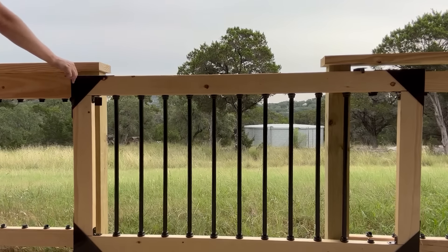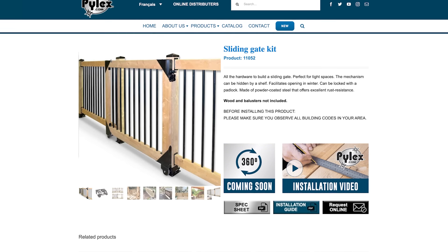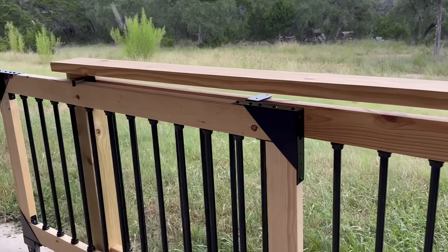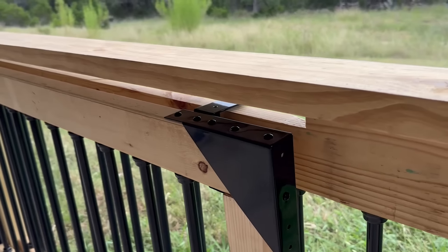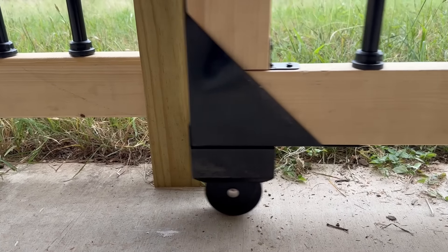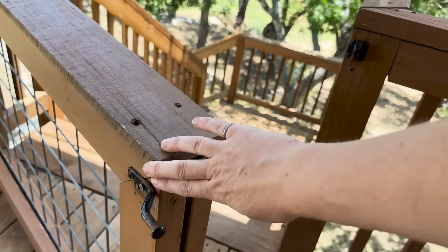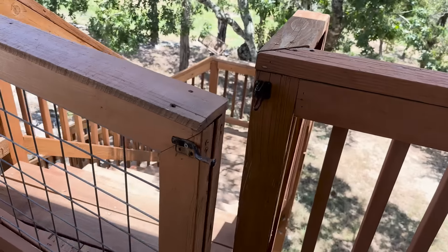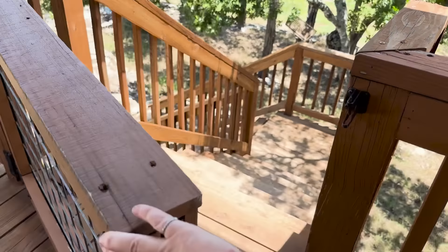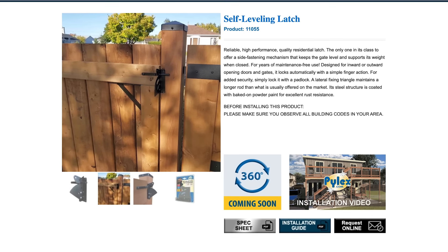The system I'm going with is made by a company called Pylex, and there's a link in the description if you want to check it out. I'm absolutely a fan of the rolling option when possible, and I'm also a fan of the black hardware against the wood look — I think this is not only gorgeous, but the function is going to save me a lot of headache and adjustments in the future. One last thing to consider is installing a self-adjusting latch. If you install a traditional swing gate and it sags just a little bit, or maybe the post moves slightly, the latch won't latch and it'll bounce back. However, self-adjusting latches have a little play built into them so that they will work when things are slightly misaligned.